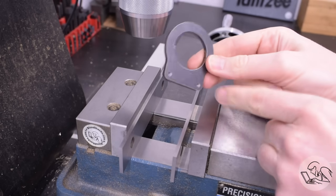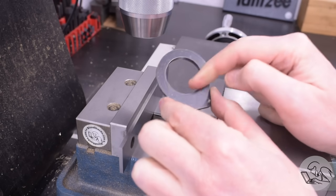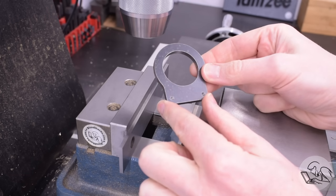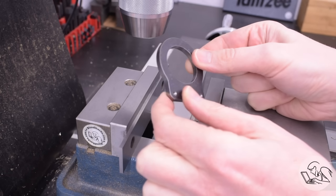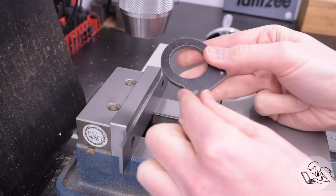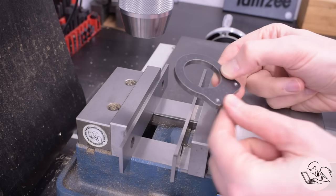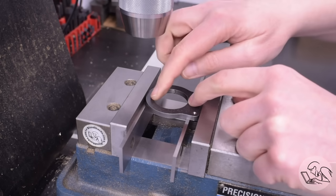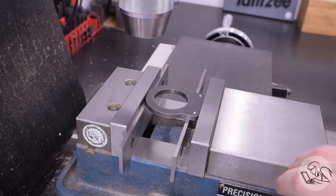I'm going to start with this piece here — it's the middle layer, kind of a hoop thing. It's got these two threaded holes in it, and relative to those holes, we need to enlarge this bore to the correct dimension. I'm going to do it on the mill because of these stationary features that need to be done relative to the bore. I would like to hold it in the lathe, but the outside is laser-cut, so we can't really hold it very square. So I'm going to have to do it on the mill, and that means the boring head. Regular viewers will know I'm not a huge fan of boring heads — I find them tedious, and they don't do as nice a job as boring on the lathe does, but I think this is the right use case for it.